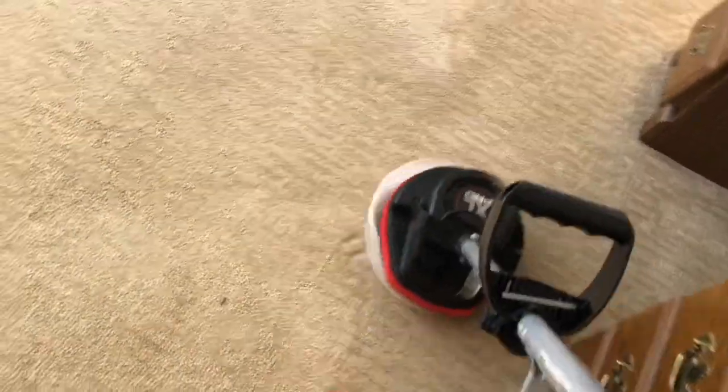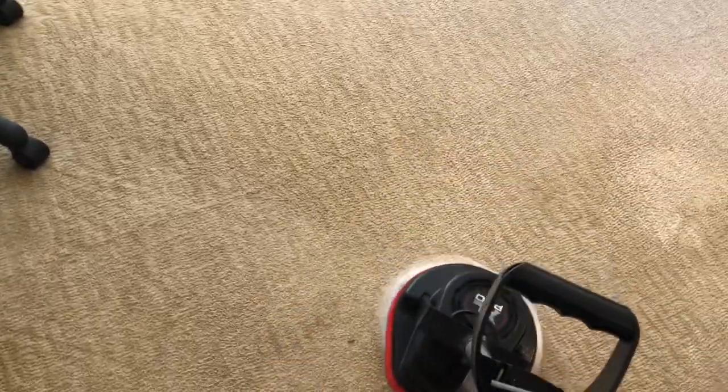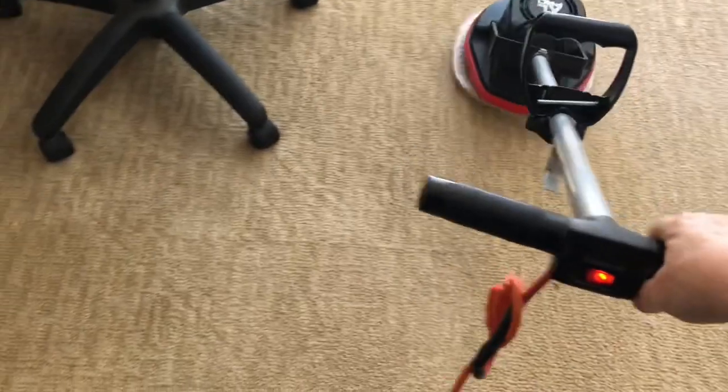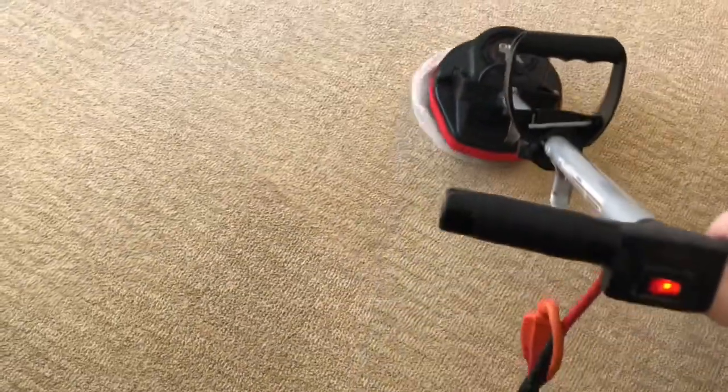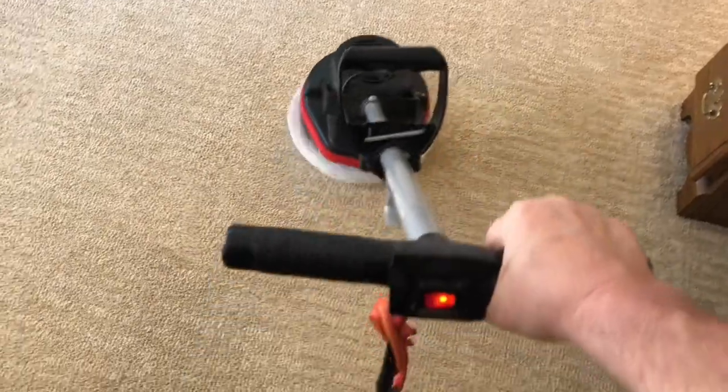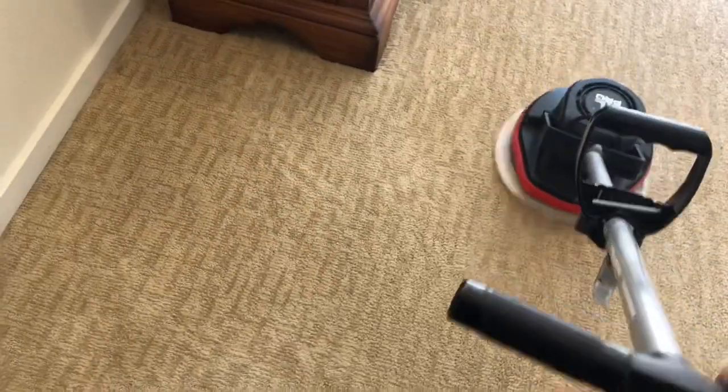But I did do a little test at the job before this. And sure enough, it looked pretty clean with the microfiber. I think if you use the microfiber scrub strips, you're probably okay. But just the regular microfiber, it's more spongy, like I said. And so it is holding water, but it's actually leaving a bit of moisture behind. When I threw a dry Ironman pad on and then went back over about a 100 square foot area, I absorbed a lot of soil. I flipped the pad back over, went over it again, and it was just lightly soiled. So a lot better clean visually, and just looking at it for aesthetics after using the Ironman, it looked outstanding, beautiful. So I can't remember who mentioned that. Somebody contributed in the comments, and yes, you were right.